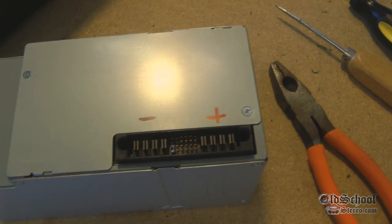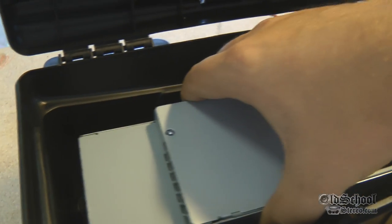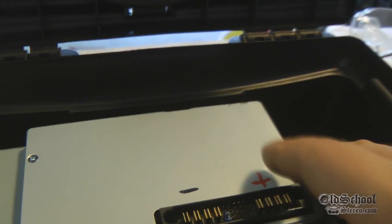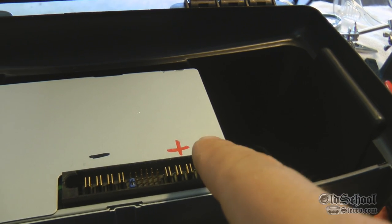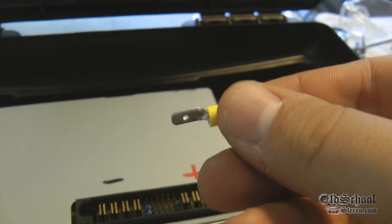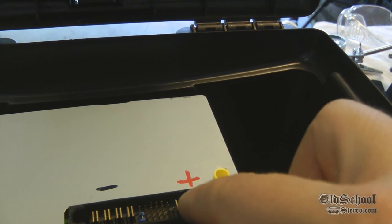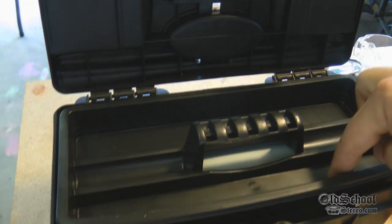Now we're test fitting the power supply in the toolbox. The best way to put it in is this way — when I butt it up against the side I'll be able to cut out a hole here for the power plug, and we have access to the terminals here. I use these little 10 to 12 gauge spade connectors — you can put them in here and they actually snap down pretty well. One problem with the other model was the wires had to make a hard turn, so I'm going to try bending these to an angle — maybe the first and last one to 90 degrees — so the wires can lay over nicely.